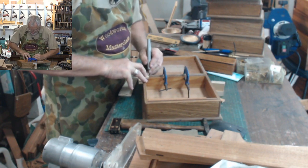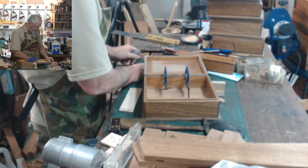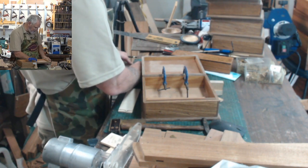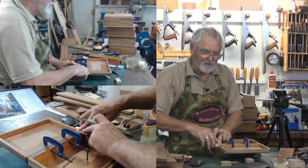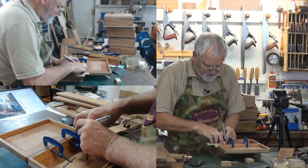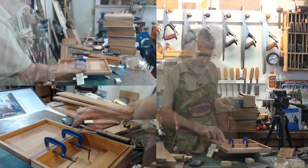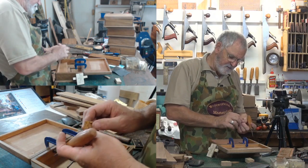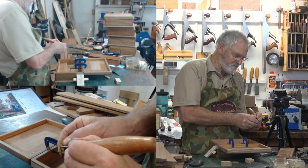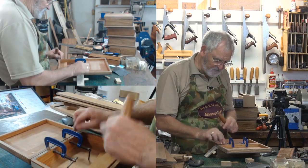The reason is not all hinges are made the same. It doesn't matter if they're pressed or mass produced like these ones are — there will be slight variations in the castings. You can also use the jig as a fence to hold your hinge up against, and then just mark it. I always mark right or left on the top, so I know which is which. As I'm looking at the box, this is the right-hand side, so I'll mark that with an R. When I put them in the box, I can easily pick it up — R is the right-hand one, and the R goes to the top.